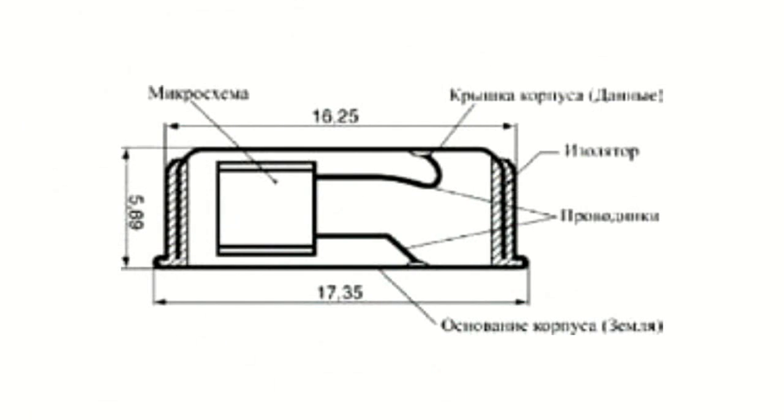The disk consists of two electrically separated halves. It is empty inside, and the electronic circuit on a silicon chip is inserted into the sealed cavity. The socket output is connected to the halves by two conductors. The disk halves form the contact part of the single-wire sequential port, so that the data line goes through the central part and the outer jacket is the ground.